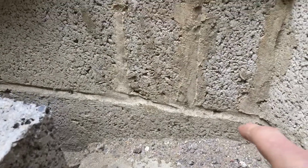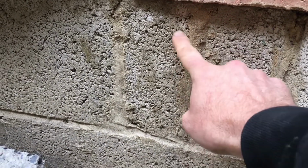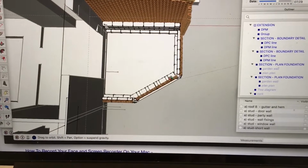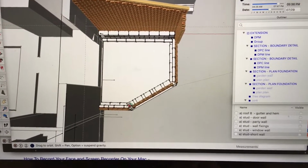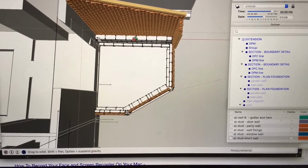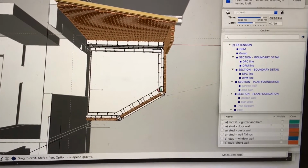around the outside of the structure, so that gives me something easy to mark on. I'll just go over to the other side and draw my line wherever I need to using that laser line. So that gives me this line here and this line here at right angles to the back wall of the house that I need to define this corner and this corner. But now I need these lines here that are parallel to the back wall of the house.